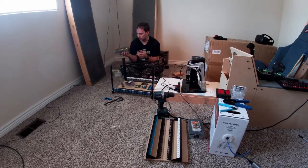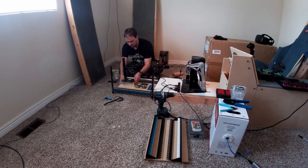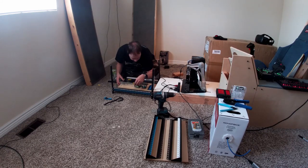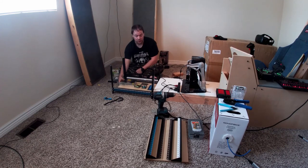I have to make my own power adapter that goes into the wall for this thing, which is going to be annoying. There's a live, neutral, and ground, so I've got to actually make a plug for this. But I've got plenty of extra cable sitting around so I will do that. Coming off of that I've got three commons, three voltages, and an adjustable voltage. I'm going to mount it horizontal - it means I've got less real estate on the first shelf, but that's just fine. I've got a hole back here and a hole over there, so I can literally just screw that in.